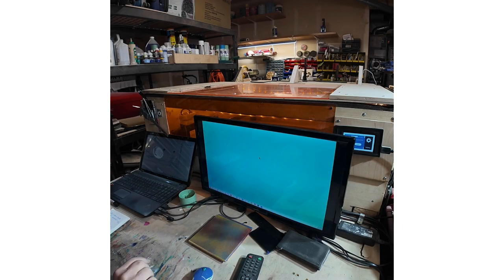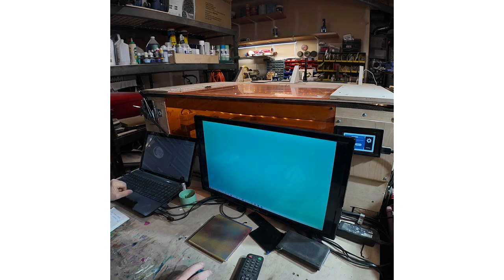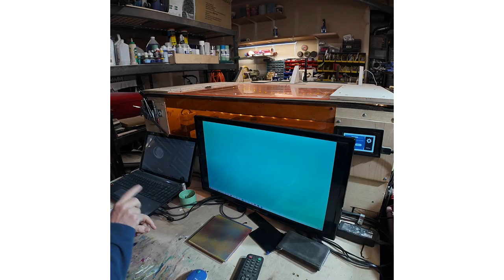Okay, we have a little change in direction this morning. I just got the notice that Lightburn release candidate 5 is out, so we're going to spend a few minutes loading that up. Release candidate 4 worked fairly well, but it had lots of problems with dropping communication of the laser, particularly if you left it on overnight. It had issues where the main process lost communication with the spawn process, which is what's actually moving the laser head around. So those are some things you need to look at. Generally, the rest of it was pretty bug-free except for the move page. None of the arrows worked. You couldn't move the gantry around, so you had to use a little icon and then place it where you wanted the system to run from. But otherwise, you know, the folks at Lightburn are being responsive.